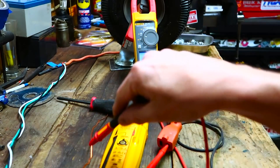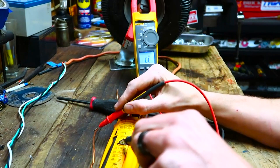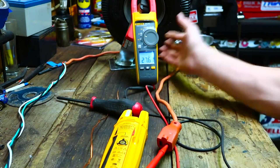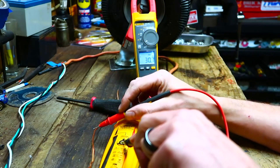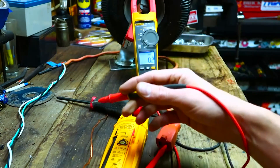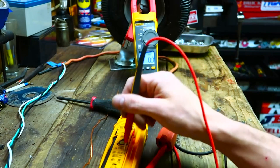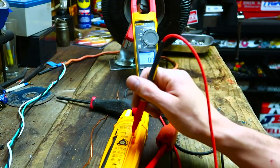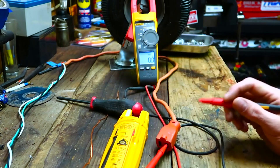We have a ground here. So if I touch the ground and this pad — in AC volts mode — touch the contact pad, touch the ground: 74 volts. I noticed in his video he was only getting about 106 volts, and I'm like yeah, that's really weird. I don't know what's inside here but it's not a resistor I don't think, and it's definitely not a solid metal connection. There's no continuity.